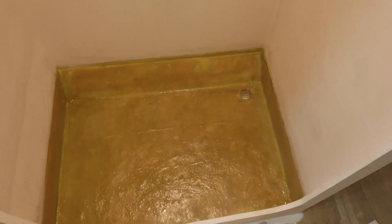That's in. There's a bit of tidying up needed around the plug hole where I've pulled some of the top layer of glass up, but I'll sand that back before I gel coat it. I'm only going to gel coat up to the edge there. You can see where I've come up to all the way around - this corner got a bit of a build-up but it'll make no never mind. It's catalyzing off now and giving off some serious heat. That's cured off now and I've sorted out that back corner. Tried the spout - fits well. It's late.